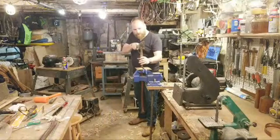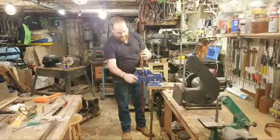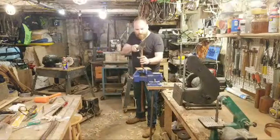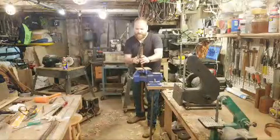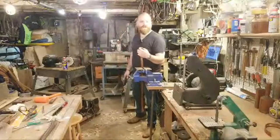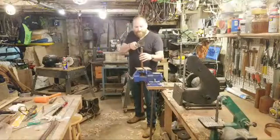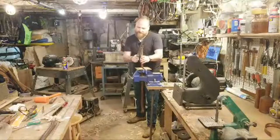And someone mentioned earlier about cutting your kerf before you hang the head. I suggested waiting if you can, if you're using a handle that doesn't have a kerf cut into it, wait till you fit your head mostly before you widen or cut the kerf, because then you're not smashing that kerf shut and then having to widen it later. You're fitting everything where it's nice and tight. And obviously, once you put it back in, things are going to close up, because where you were fitting nice and tight is now going to be some spots where it's going to squeeze that kerf shut.